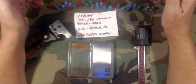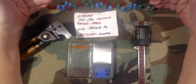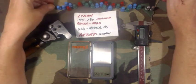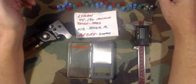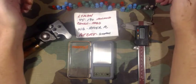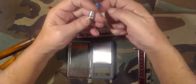Last summer I really went to town and cast a whole bunch of stuff. However, handgun bullets are kind of low priority for me, so I didn't cast that many — in fact this is all I have for the 45. I wasn't really going to shoot these in a 45 Auto; I was going to shoot them out of my 45 Colt adapter for my shotgun. The last time I did testing on that adapter I had really horrible results — I wasn't getting any bullets to stabilize, whether ones I made or ones I bought from commercial casters.